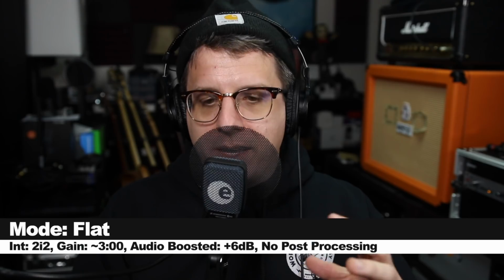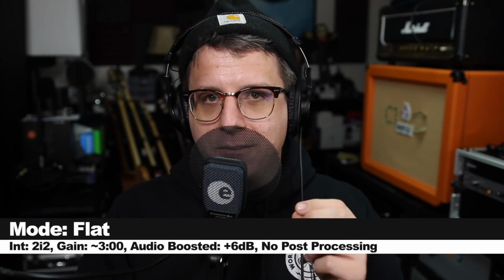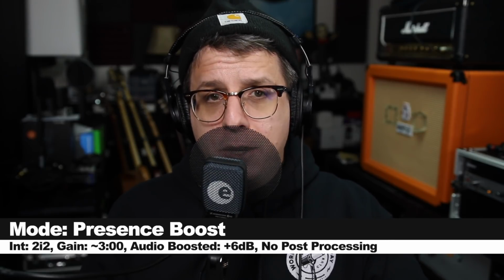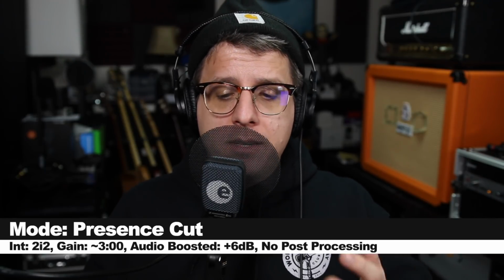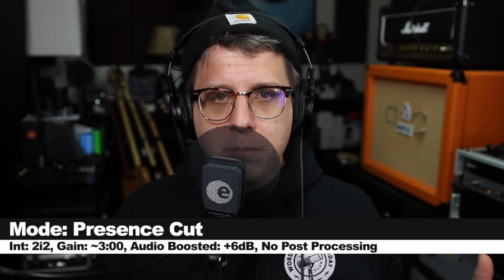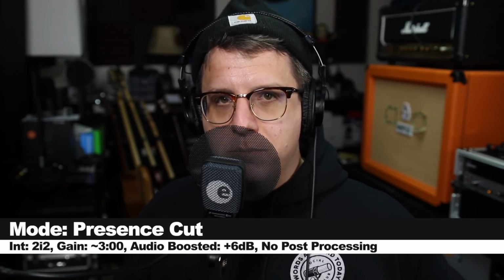God. Okay, so throughout this video, I have been speaking into the microphone with the presence set to flat, and this is how it sounds. Now I've enabled the presence boost on this microphone, and this is how it sounds. And as you can hear, there is a lot more crispiness up top. And now I've enabled the presence cut on this microphone, and this is how it sounds. You can hear that it has a much darker tone now, but to my ears, it also sounds a little bit smoother.